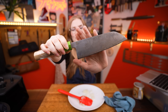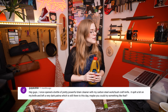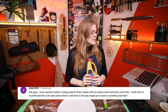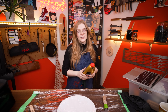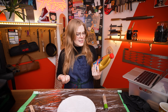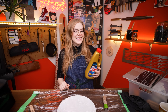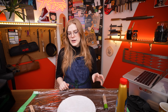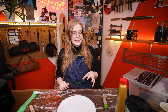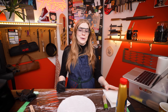This is the drain cleaner method. A commenter said they once opened a bottle of pretty powerful drain cleaner with their carbon steel work knife, it spilled a little on it, and left a very dark patina that's still there to this day — maybe you could try something like that. So here we are doing exactly that. This is kind of like etching with the ferric chloride we did earlier, but maybe even a little bit more corrosive. I'm going to brush it on with a cheap brush, not leave too much of it on, and see what happens — kind of flying blind here.